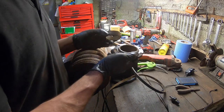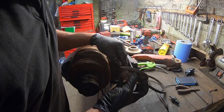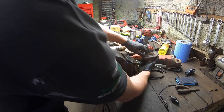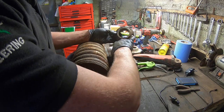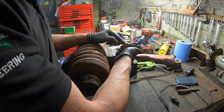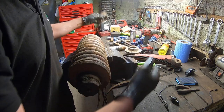I've pressed off the top of this, and as you can see, there's the worn out bush. But I have a bigger problem with this. I think I'm going to have to get one of these collars, because there's an actual lip edge to retain it. As you can see, there's no lip edge here, and you can see the lip edge there. It's to help retain that bush. So I think one of the best moves here could be to buy a new one of these, because it's been moving around for so long that these holes are also slightly elongated from moving around and the bolts that were worn. So there's a few different points of wear on that. It was also rubbing off the housing here. You can see there's a wee edge lip on that there. So I'm thinking I'm just going to get one of these collars here to replace that one, and then we'll put the whole lot back together the way it is.